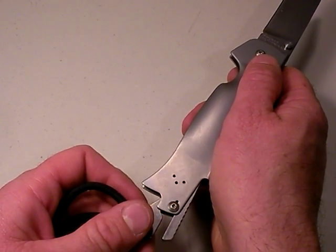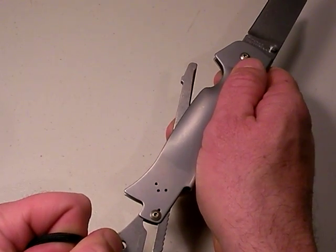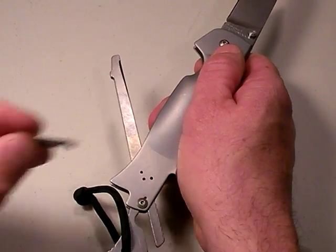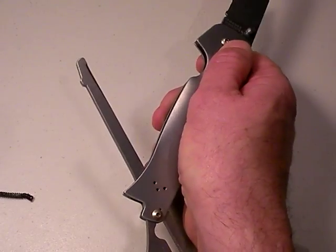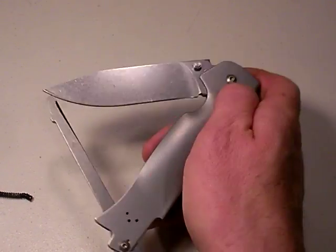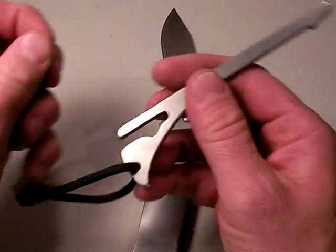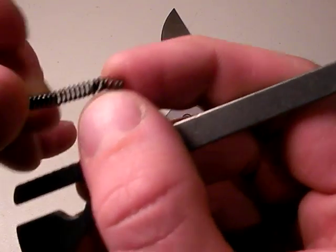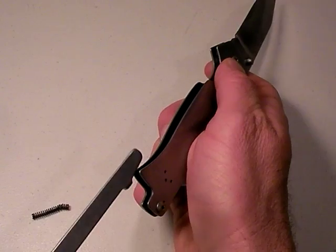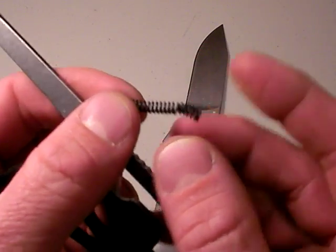There is no retention to the plunging mechanism. I compressed the spring so much that the lever popped out of the handle, just like you see here. As that spring rotated in the groove, it got wrenched and bent — it happened in a blink of an eye. Next thing I know, I have a knife that has to be put back together. I attempted to pull the plunger mechanism out, and this is what I was faced with: see that spring, how it's kinked? It happened instantaneously — it's not something you can predict.